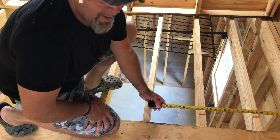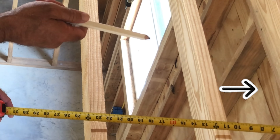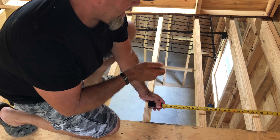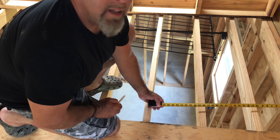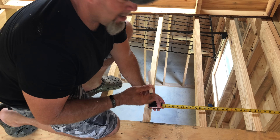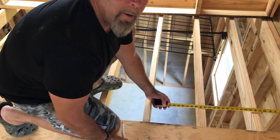The first problem that I ran into today was whenever we laid these ceiling joists out, we laid them out on the outside ceiling joist. We've doubled that, throwing this floor off about an inch and a half. So now to get this flooring right, to get it started out right, I'm going to have to cut an inch and a half off the first sheet. That way it'll fall back and your two-foot mark will be on the centers.